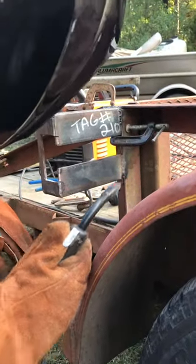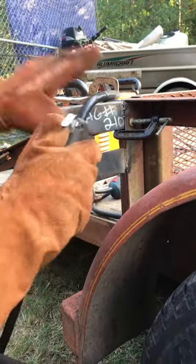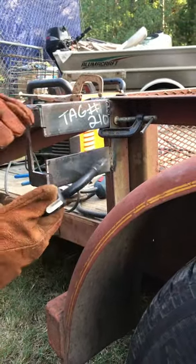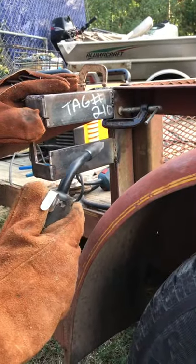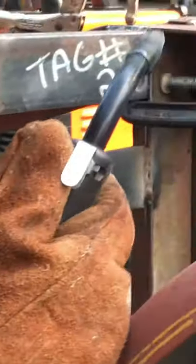It's pretty interesting watching the welds line up — just like drawing a line. Son's got some pitting right there. I could've done better — going too fast on that spot. I should've swayed back and forth a little bit while doing it, and that helps bond the two pieces together.